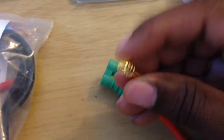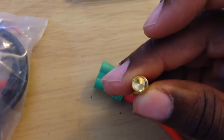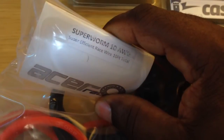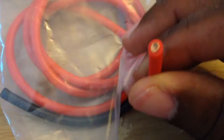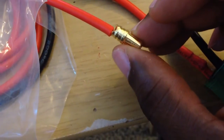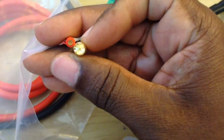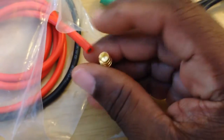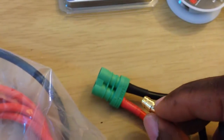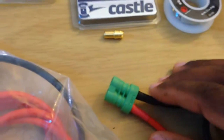What he did was he manipulated the inside of this connector by dremeling some of the edges — widening it up so you could fit two cables in there. These are 10 gauge, and I believe he used 10 gauge as well. But you're not squeezing both of these 10 gauge ends inside a bullet like this — I tried. You've got to squeeze the hell out of it with the solder on it, and then it has to be flushed so it can fit inside the housing. His method didn't work for me.